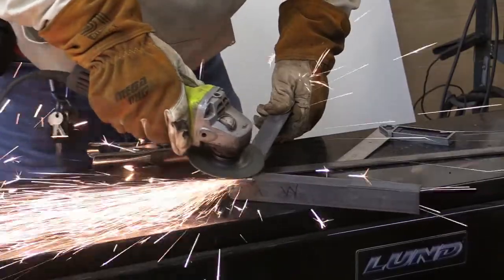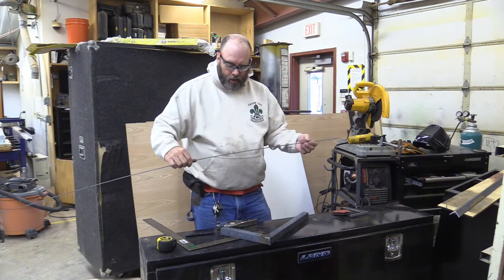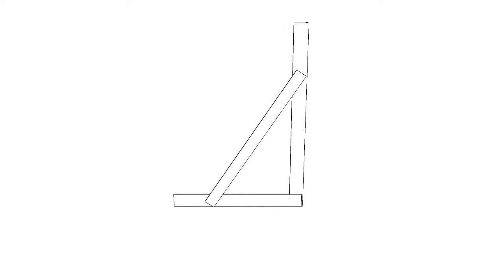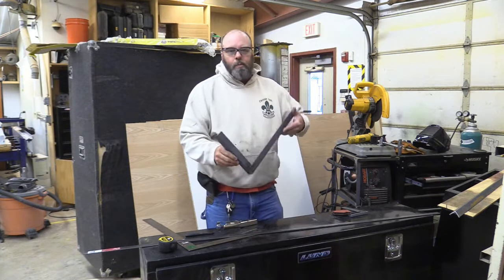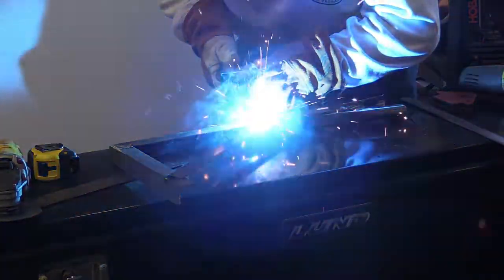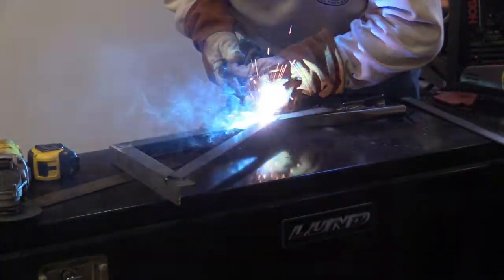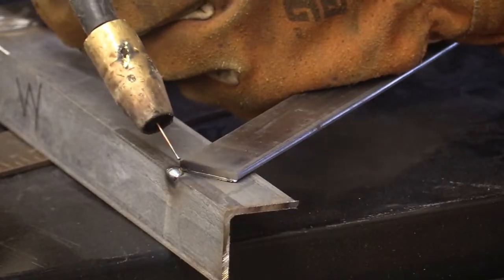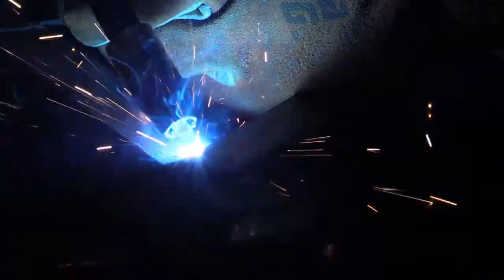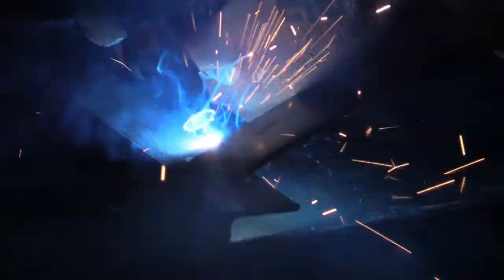The next thing we're going to do is clean up some of those welds, and also take this one-by-one-eighth-inch piece and literally make a diagonal brace. I don't want to rely on three inches of welds plus what's attaching it to the trailer to hold up hundreds of dollars worth of straps. If we can add a $12 piece of metal — a $3 bracket — to save hundreds of dollars worth of straps and chains, it's worth it.